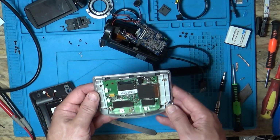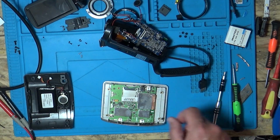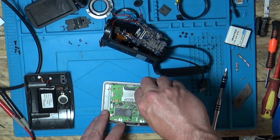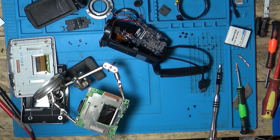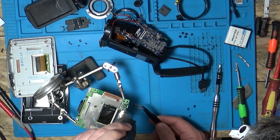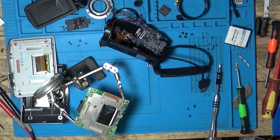Right, found an old TomTom that I was trying to fix before that had a damaged port as well, but changing the port didn't work on it, so I shall borrow this one now. Sod fixing the TomTom, it ain't worth much. Heat it from the top, and hopefully the port just drops out without melting any of it. And off she pops.